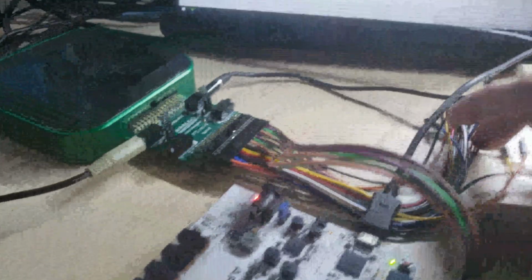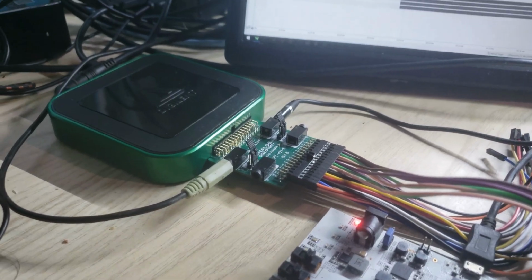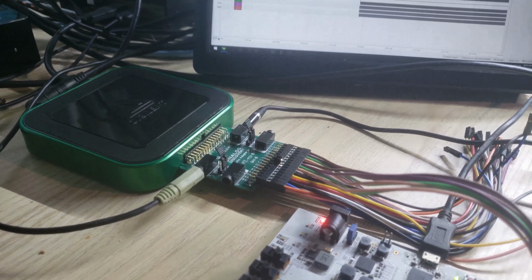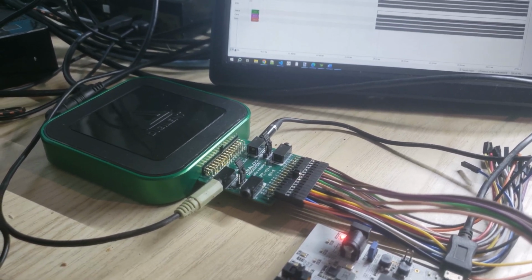Nice. So in terms of the physical connections on the AD3, the ADP2230 and the ADP3450, what are we talking? Because I noticed that the Pro had some proper BNC connectors. Yeah. Starting with the AD3, we have the test point leads. These are kind of the standard for a lot of this kind of device. They do run into bandwidth limitations just because it is a long cable that introduces capacitance.